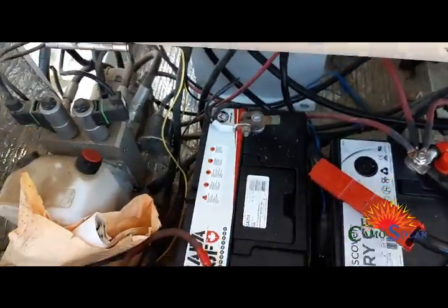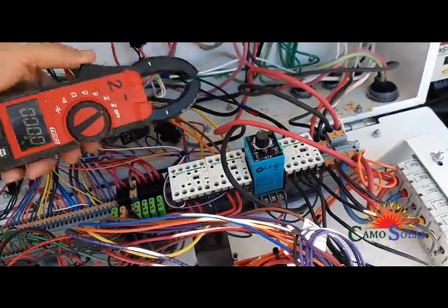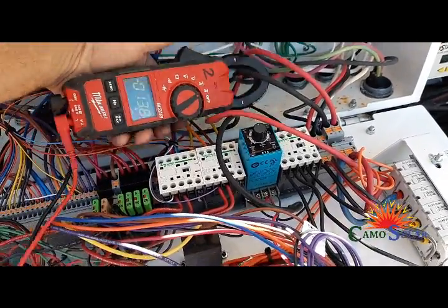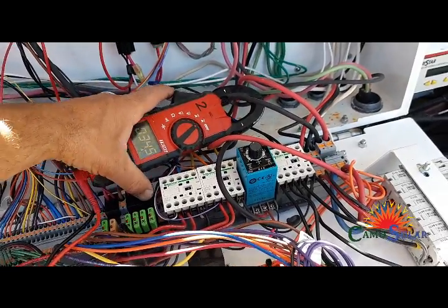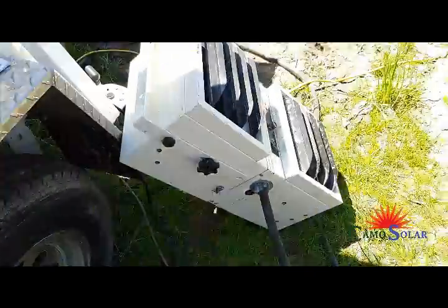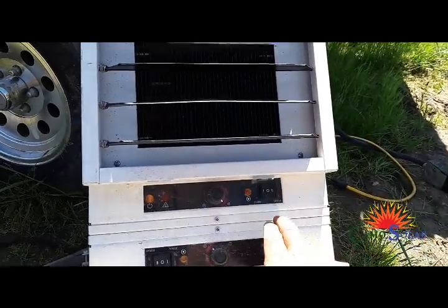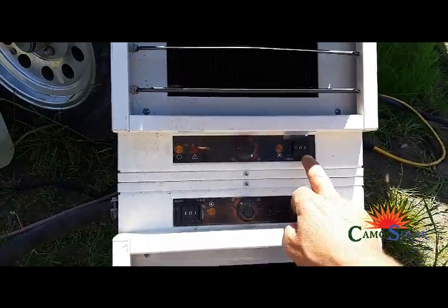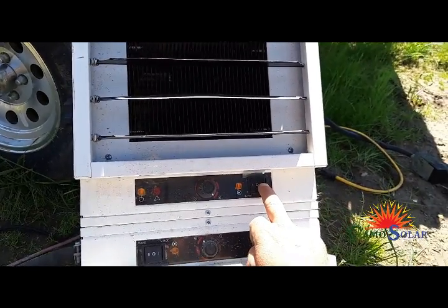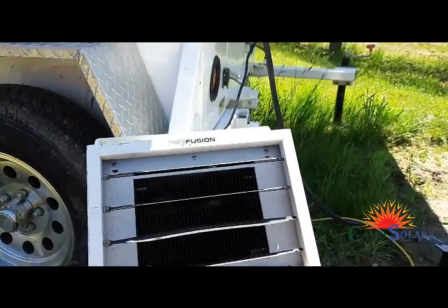Every system, you're always best to load it to its max and make sure everything works right. I'm pulling 34 amps on the black and 45 amps on the red. What I have here is two 5,000 watt heaters hooked together. I have it on 3,000 watts — then 5,000. Then I can add another 3,000 and now 5,000. I can load the generator progressively: 3,000, then 5,000, then add another 3,000 and then 5,000.